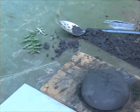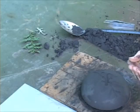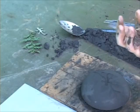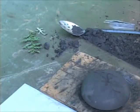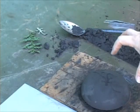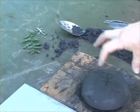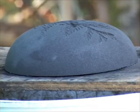It's important not to touch it. If I were to touch it with my finger, I would disturb the packing of the sand, and the raised particles would adhere to the glass when it gets poured on top. The idea is to leave it packed as tightly as possible so the glass can't attach to it anywhere. That sand is packed so tightly the surface is shiny smooth — that's exactly what I want, so that I get a nice shiny smooth surface on the resulting glass casting.